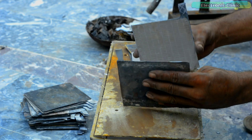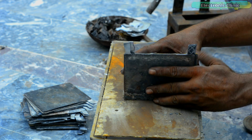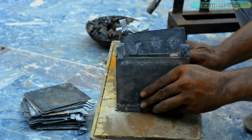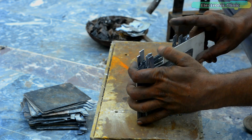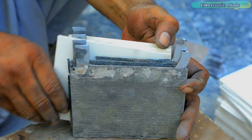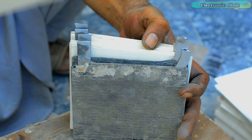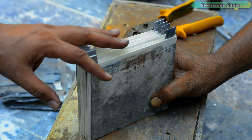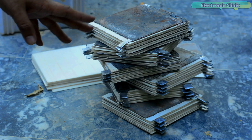For making a cell, keep the ground plate's contacts on one side and the positive plate's contacts on the other side. Place the separator sheets with the rough side towards the positive plates. The battery cell is ready. We have 5 ground plates on one side and 4 positive plates on the other side, and all 6 cells are ready.